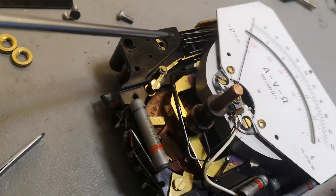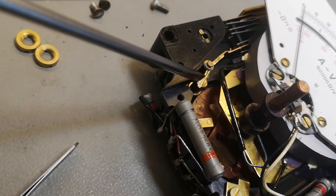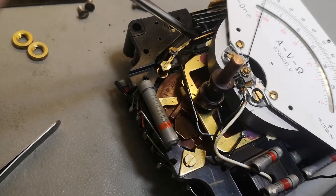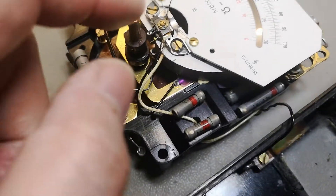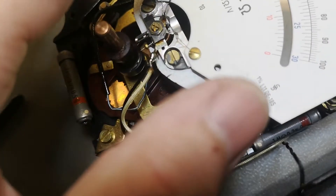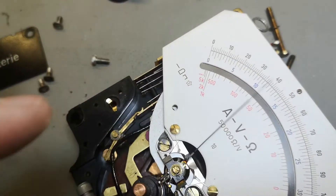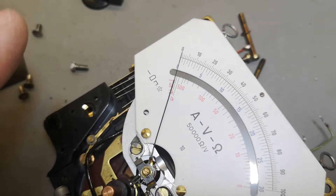It is very compact with all the resistors hidden in every little space they found. There's even a little contact here. I didn't see - ah, so this is the rotation, there's probably something that pushes this. Now it is in center. I think there was a little bit of metal dust in here in the magnetic gap and that was touching the needle. Now I cleaned it up a little bit and it works. It doesn't really go back to exactly zero every time - there's a little bit of mechanical slip-slap.